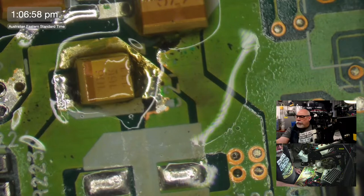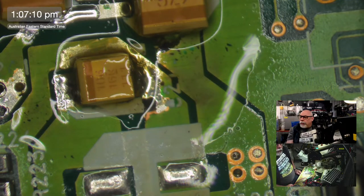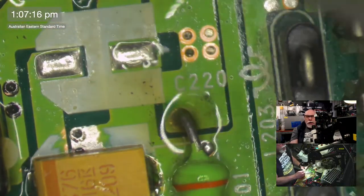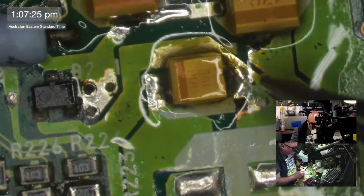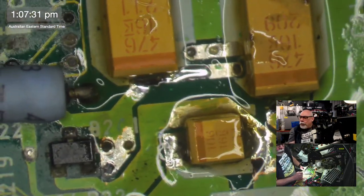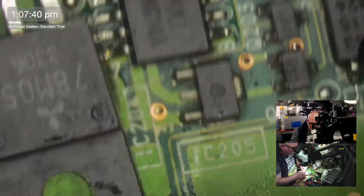It's just a board, nothing to solder to. Don't know the term. So are you saying it's sort of something like what we're looking at here, where it's a flat pad for you to solder onto rather than it being a through hole like this? So this here is a resistor and it's through hole and it has pins that come out the side and go through a little hole. Or the alternative is these ones here, which are surface mount, which just have pads on there and you solder flat onto those pads. Or the pads were ripped off. That's another thing, of course. You know, that can happen. Ripped a few off myself.